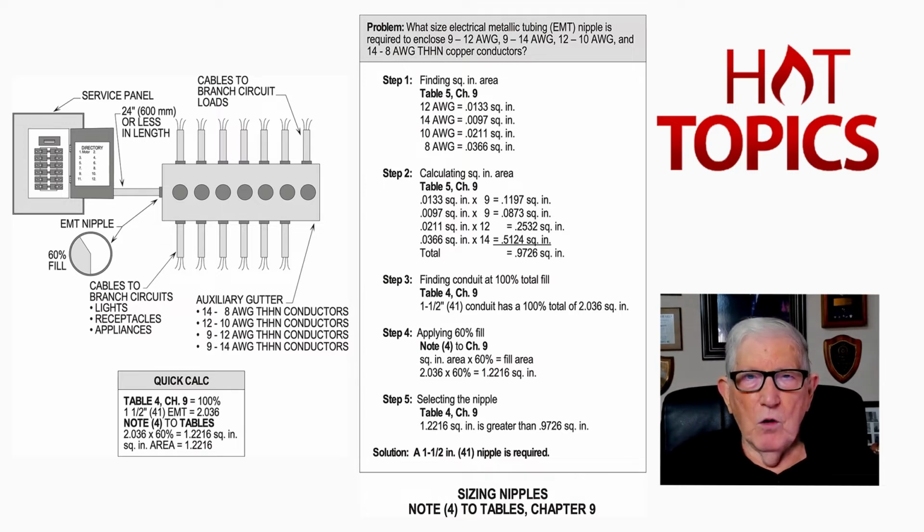So, we can bundle up to 2 foot or less conductors or cables, and we don't have to derate, do we? It's when we bundle them over 2 foot and we don't allow space between those cables. And a lot of times, the authority having jurisdiction says, well, if you can take a piece of paper and that paper will go between the cables, that's all right. And some say, no, it's the distance between the cables based upon the width of the cables that they want to look at. So if you had, I'm just saying this, say you had a quarter-inch cable, that'd be a quarter-inch between them, or just the paper that would flow freely between the cables. You have to talk to the authority having jurisdiction on that if you bundle over 2 foot.